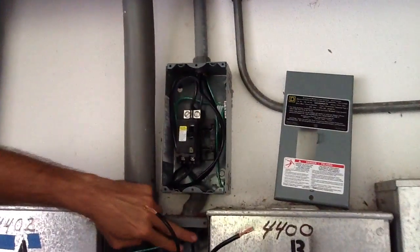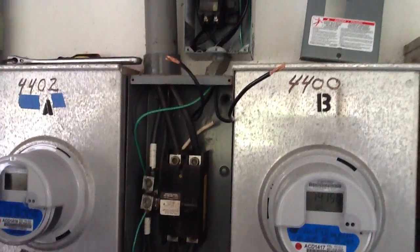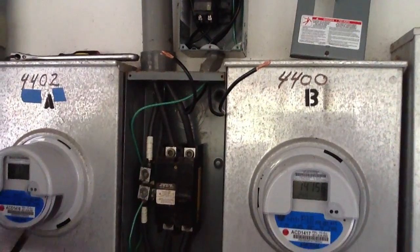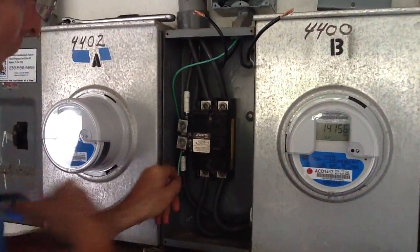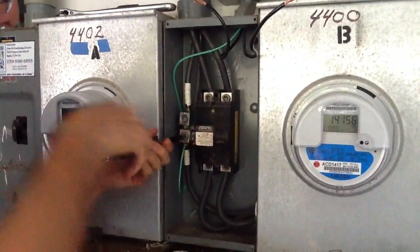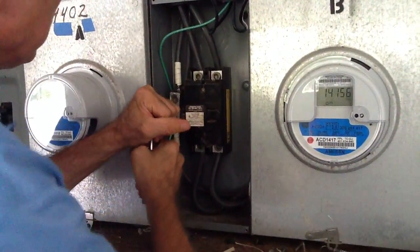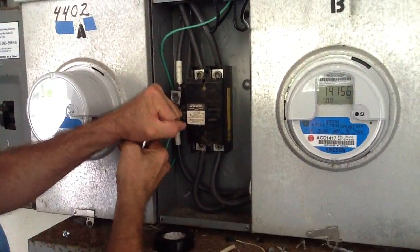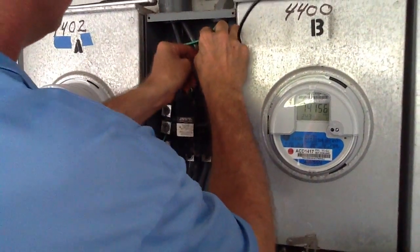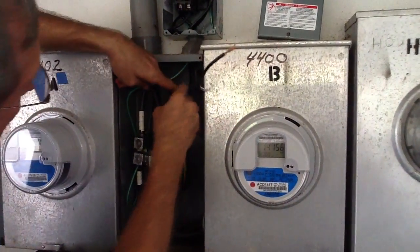What we've done here is we've actually pulled in two new wires. Down here this is the ground wire — ground is always green — and here are the two wires that I'm adding in behind the lugs. As a general rule when you're doing electrical work, you always want to put your grounds on first and take them off last. I'm actually just tightening this up. I'm sticking these wires in behind these lugs using a three-eighths Allen key.